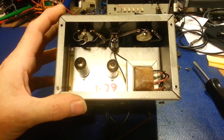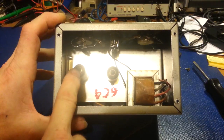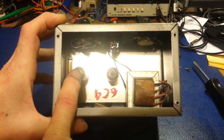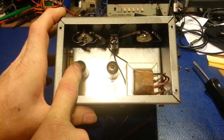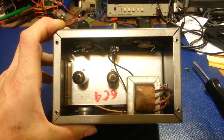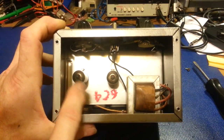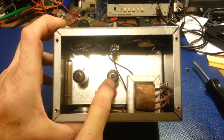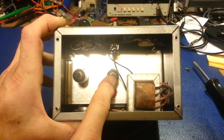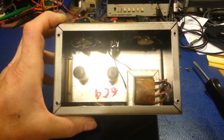There's not a lot to them and parts really wouldn't be that bad. The two tubes — the 6BA6s — I personally have probably 150 of these things left. That was a very popular tube in military equipment, so I have a small stockpile of JAN mil-spec tubes. And same thing with 6C4s. If I was to start making these, I'd probably buy a bunch more, and those were also available as mil-spec tubes — just a lot heavier duty construction.